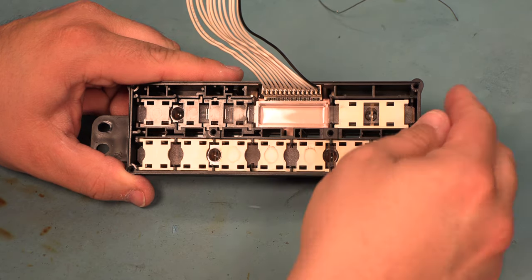we're going to use some tweezers. We'll use a small amount of heat, and we'll use an X-Acto knife. So we'll start by applying heat to the side with one leg. Using the X-Acto knife, we'll lift the component away from the board. Next, we'll heat the side with two legs and finish removing the component. We'll repeat that process for all of the transistors on the back side of the board.